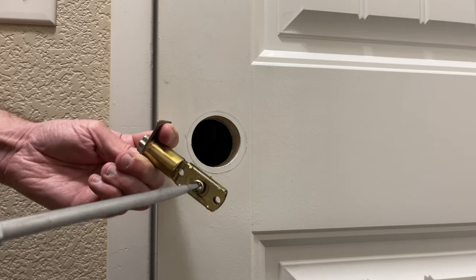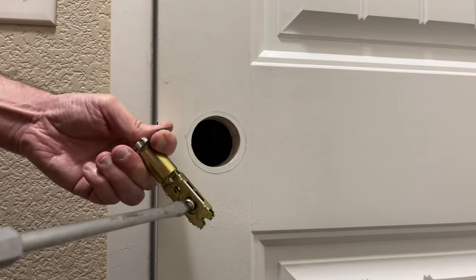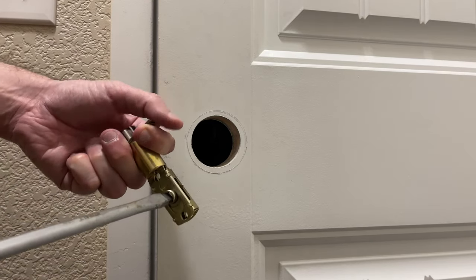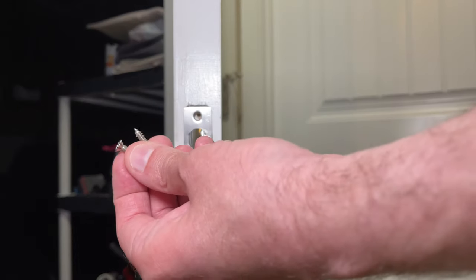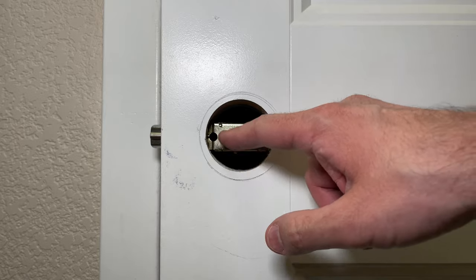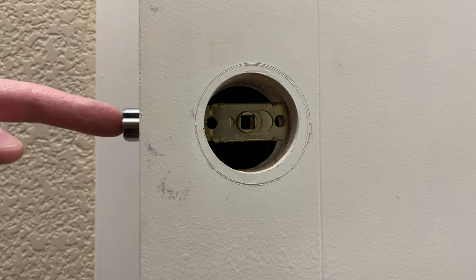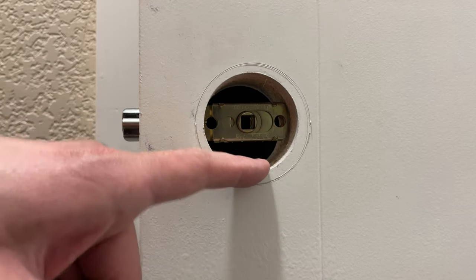You see how it unlocks when you turn it down. And if you were doing it on the opposite side, you would turn this all the way to the left until when you turned it down it would unlock. So since my door lock is on the left-hand side and it opens that way, I need to rotate it all the way to the right so when you push the handle down, it unlocks the door. I'm going to use the screws that came with my old door lock just to make it easy. You want to make sure that the little hole here is directly in the middle of the circle. If your door is deeper, you can always extend this out to make the hole in the middle. Also make sure that the little square is level before you put the lock in or you're going to have trouble later.